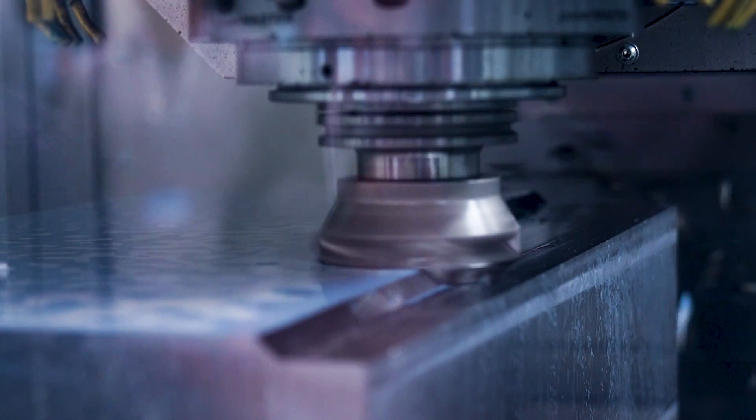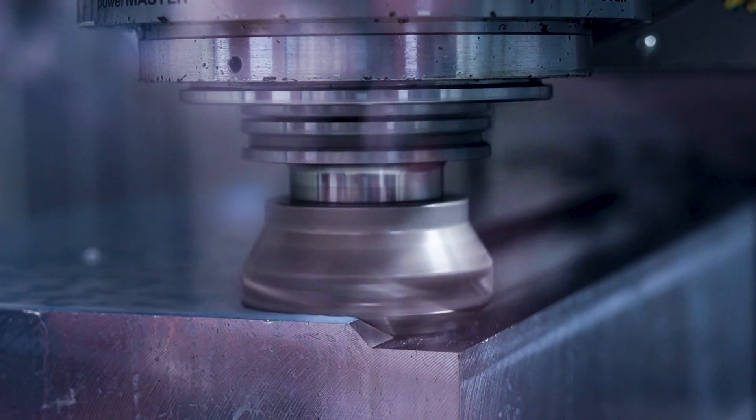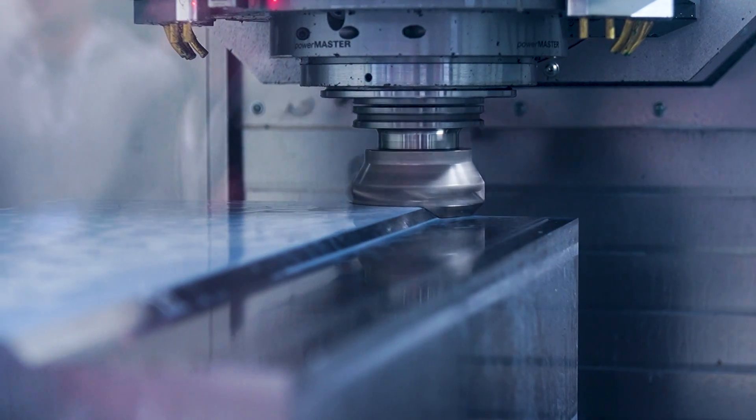Your technology cycles are a big part of what DMG Mori talked about - they would apply hugely to a machine of this type, including five axis and gear skiving. We've implemented most of the suitable technology cycles in this machine. A very impressive technology cycle is the gear skiving cycle - you need the FD option and FD table, and then you can produce gears very easily. You only have to choose your module, number of teeth, and all the parameters, and the rest is done automatically by the machine.